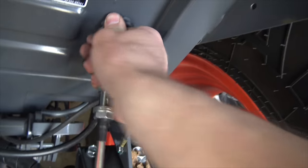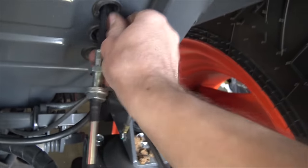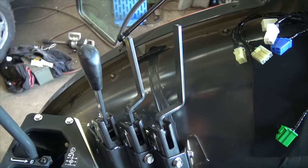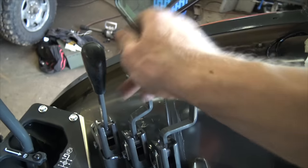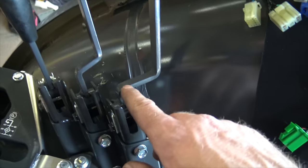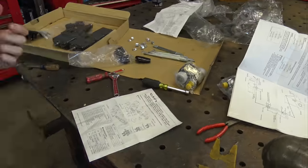Now that we've removed the plug, we basically just have to feed this cable out, pop this lip back in place, and now we can pull the cable in or out as needed. The first 'I wish I knew that' of the day: these two levers are not completely the same — one has a wider flat spot. If you put the wrong one in, it reaches over and interferes with the other lever. I had to switch them around.